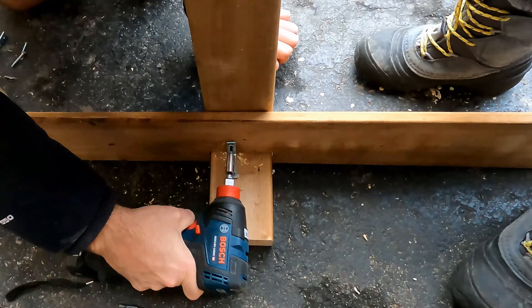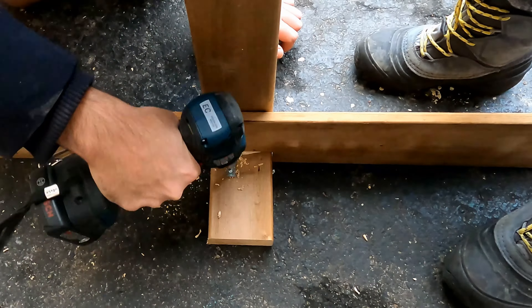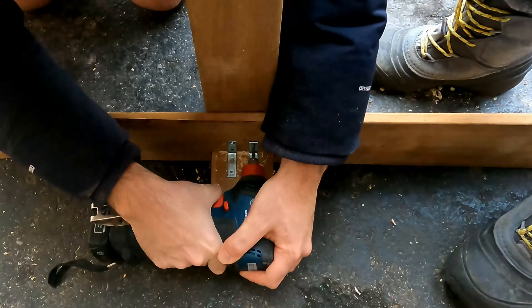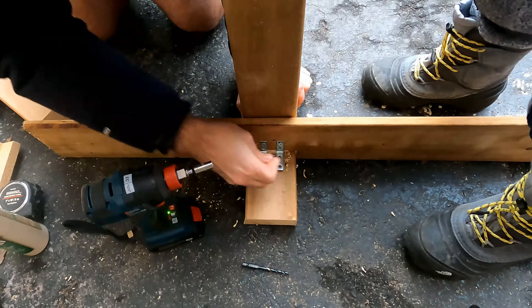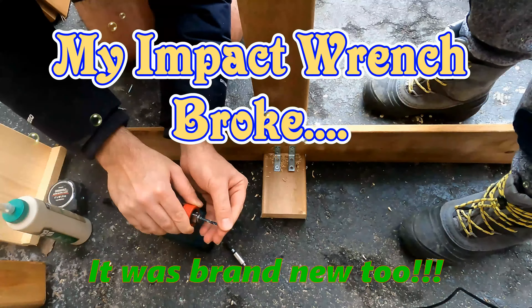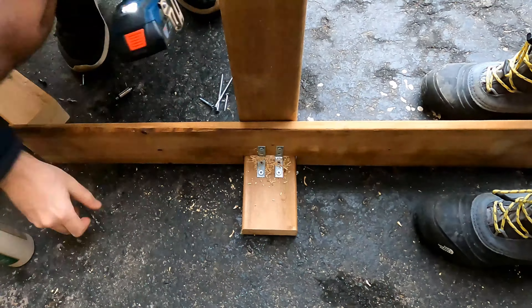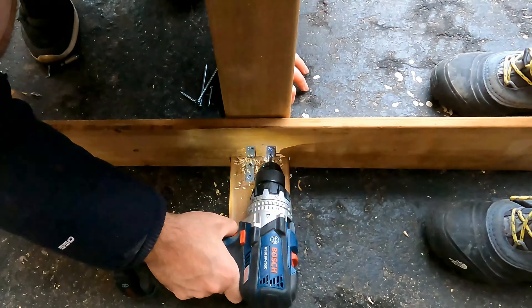Very simplistic design and very sturdy. First I attached the big two-by-four at the bottom, making sure that it sticks out three feet forward and a bit less than a foot back. Following that I attached the cross section piece extending two feet to each side, and that's it. I secured the whole thing with some metal braces for extra strength and stability. I also used a bit of glue too just to be sure, and I ended up with a pretty impressive looking stand.